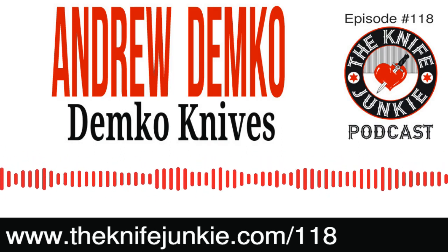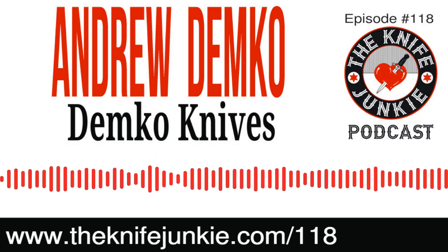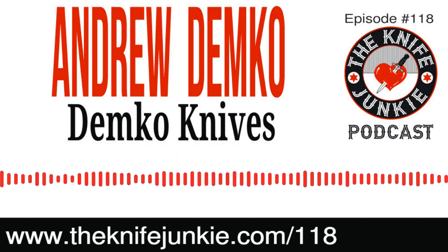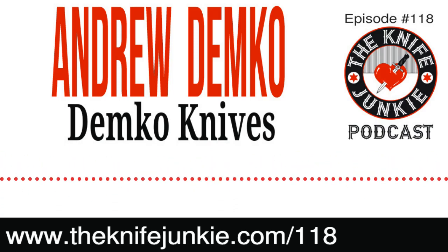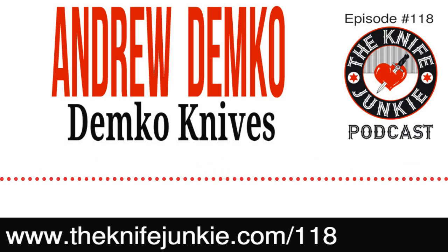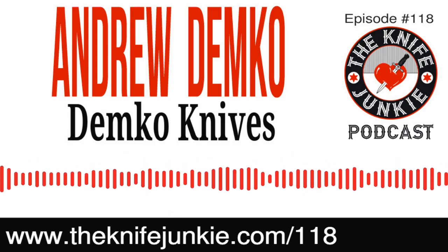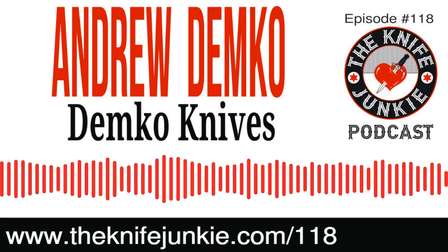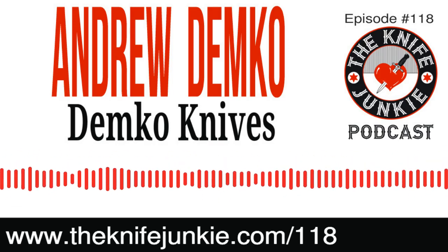In your custom shop they're a pain. But even in production they're horrible — I've had years of working with manufacturers to get them right. The tolerance of the triad lock is one half of a thousandth — they call that five tenths. Cut a regular piece of printer paper and divide it by eight or ten — that's the tolerance. If you miss that, your lock doesn't work. If you hit that, your lock is like Superman — indestructible. If you miss it, it's time for new parts.